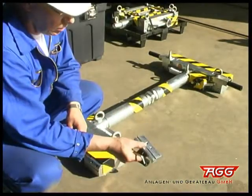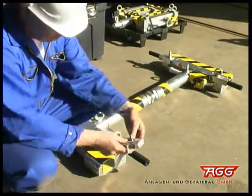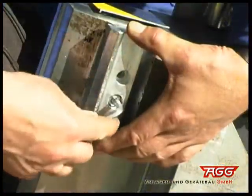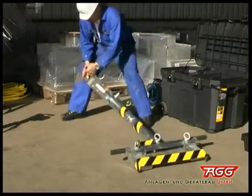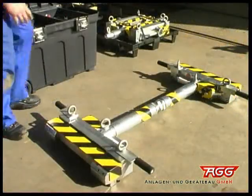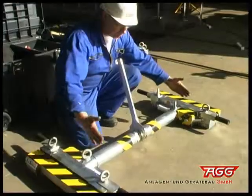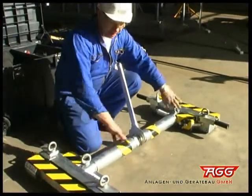As mentioned before, our measurement system can be used as of the S49 rail type. Here, you can see how to mount the UIC 60 adapters by means of the Allen screws enclosed. Use the enclosed 75mm spanner to twist the spindle of the tightening shaft. This makes the measuring heads go inwards and the equipment can be placed between the tracks.